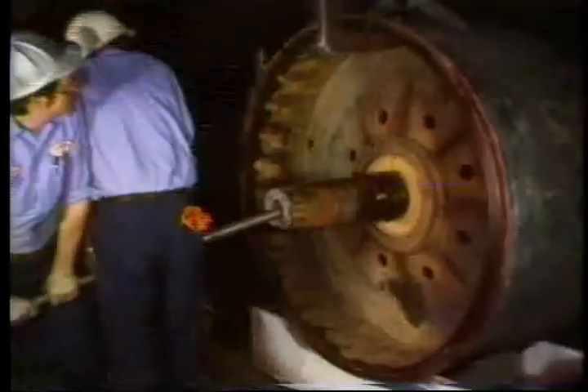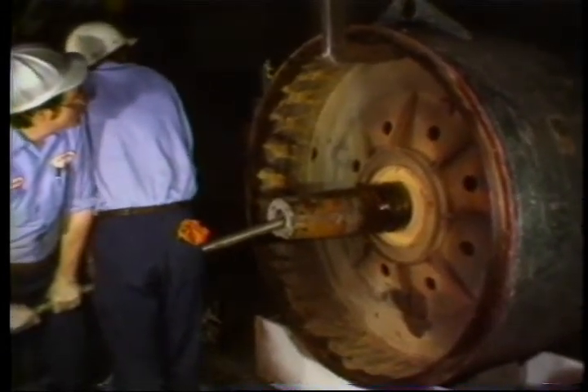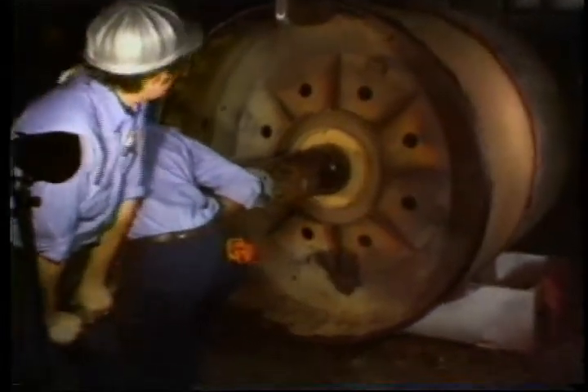Now the rotor can be worked out. Lift the weights off the rotor with a crane or hoist, use the same C-shaped tool, stick an iron bar in the shaft for leverage, and work it out — keep an outward pull on the rotor as you work it back and forth. Now check the brake housing for corrosion before you reassemble it. It should be cleaned out; check for signs of wear along the outside edges, and watch for pitting and holes. Any holes will leak — they can be fixed by welding them up; larger ones might need plates welded over them from the outside. All of these problems should be repaired before reassembling the brake.